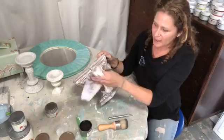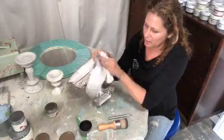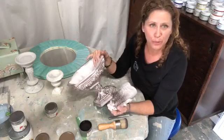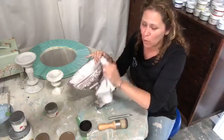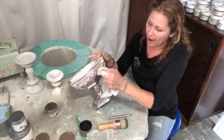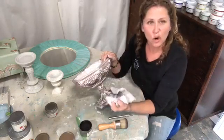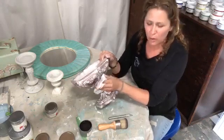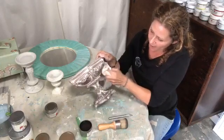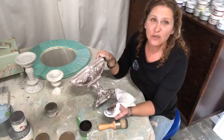Can you use it for outside pieces? Yes, wax melts, okay, Jill? Just something to keep in mind. Usually, if you're gonna have a piece outside, you want to seal it with a weatherproof sealer. Wax is not a weatherproof sealer, meaning for outside, temperature changes and rain and so forth. It is a mild type of sealer. It does cure after 3 to 4 weeks, where you can start putting glasses, let's say, stuff on. But remember, it's a wax. So if you put something too hot on it or leave it outside where the sun starts to hit it, it is going to melt.